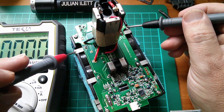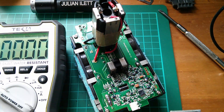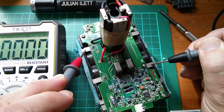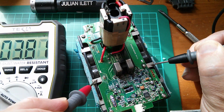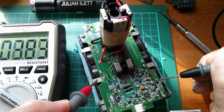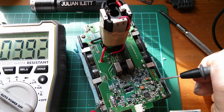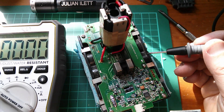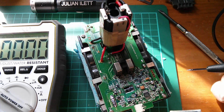So it's just the one at the far negative end that's dead on that battery. On the second one, the cell at the negative end is dead, the next one is pretty much dead, then we have 3.81, 3.81, 3.83, and 3.92. So the three cells at the positive end are good. I only need one pair of cells for the other battery to make it good, so I'm going to take the far positive cell pair out and put them in the other battery pack.